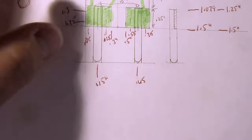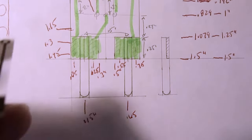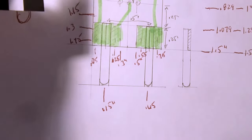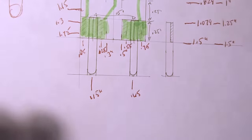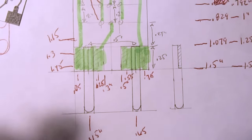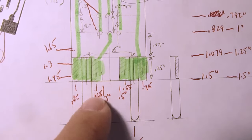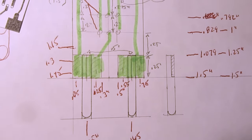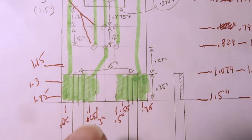And I've got some big flats on the circuit board, as already mentioned, onto which to solder those pins, so there's a lot of surface area and hopefully a good adhesion to the circuit board, so that it doesn't just peel the foils off the board if there's any resistance applied to these pins. That's physical resistance or force applied to them.